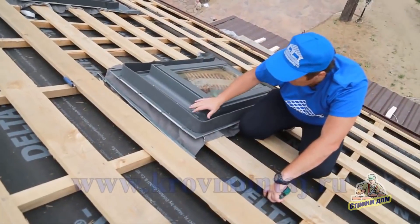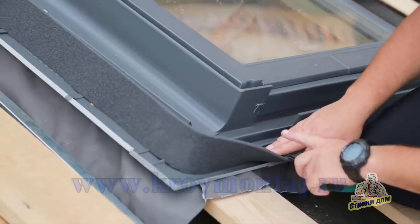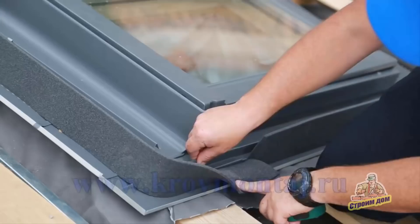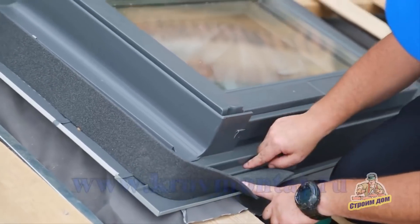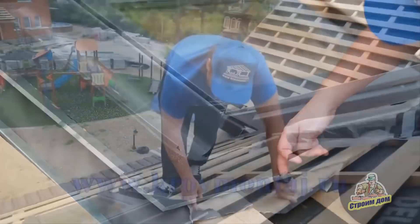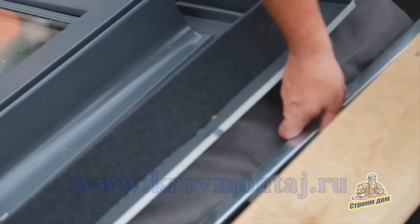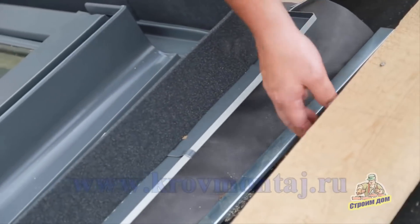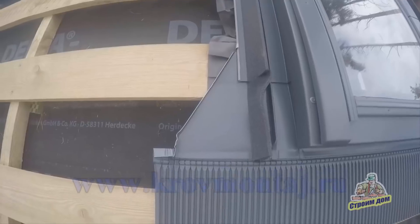In this house, we installed seven mansard walls. On top of the surface is a standard light aluminum layer with three degrees of protection. The metal tile will form a large overlap and press against the wall. Even if water passes through one obstacle, it will meet the wall barrier again. The membrane is attached to the wall and connected at the top to prevent condensate from getting under the window.